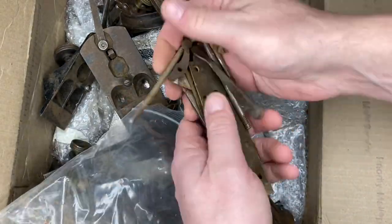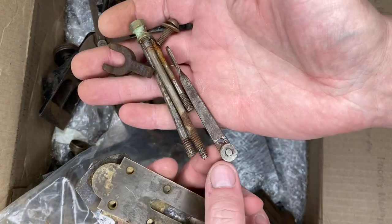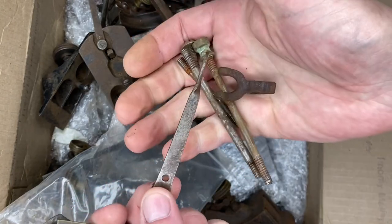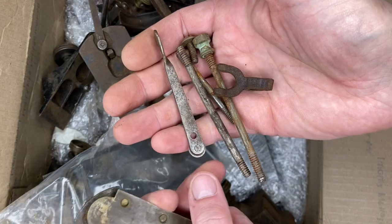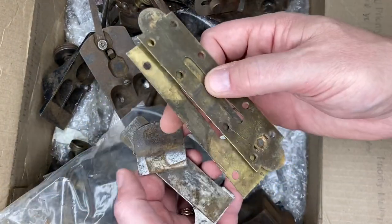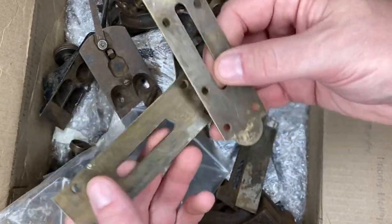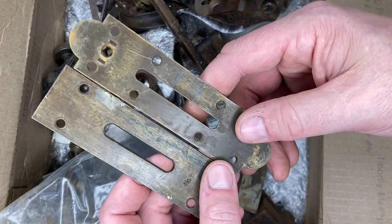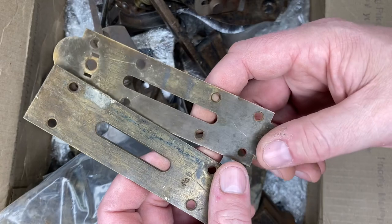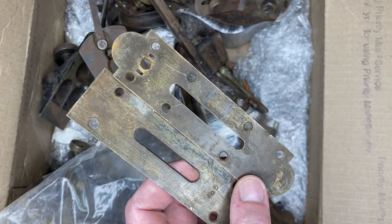In this box — other than what I showed you — just a lot of odds and ends. This frog is probably worth repairing; that's a five-and-a-half, type 10 or 11, so it's probably worth finding a lateral to put on there. A couple of other frogs: that one's a type 9 with no frog adjustment screw. Some random hardware — always looking for these to restock the bin. There's a little lateral here, probably a Wards Master Union or something made by Stanley for somebody else. And some parts for levels — if anybody needs those, I have them.